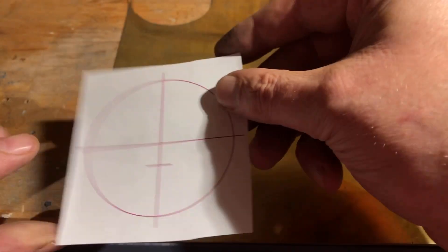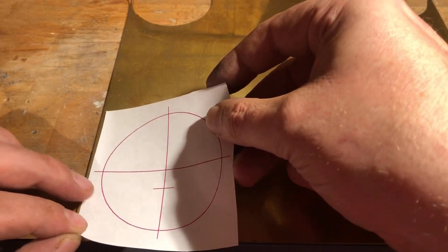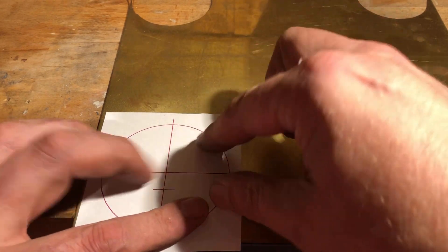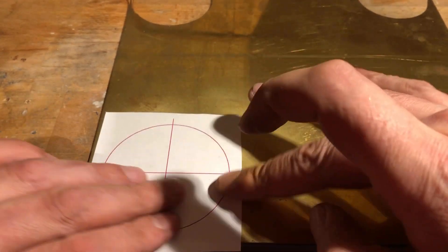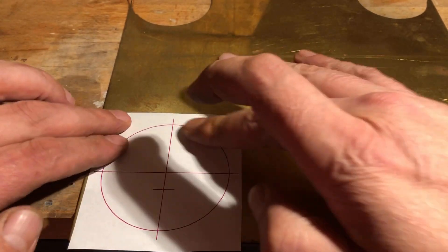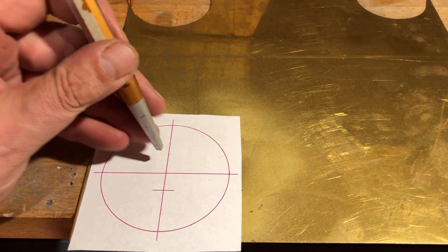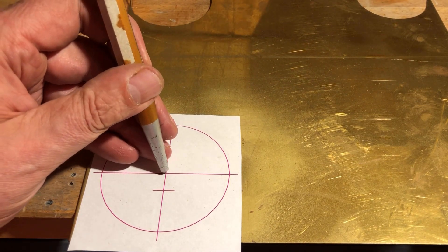Now the anode is made of a 1mm thick brass sheet with a diameter of 70mm. We need the ring electrode and the plate anode to build up an electrostatic field with a voltage of about 1000 volts. It is used to draw cloud tracks down to the sensitive region of the chamber and also serves to increase the sensitivity of the chamber. Later, we will also attach the radioactive source to the anode.